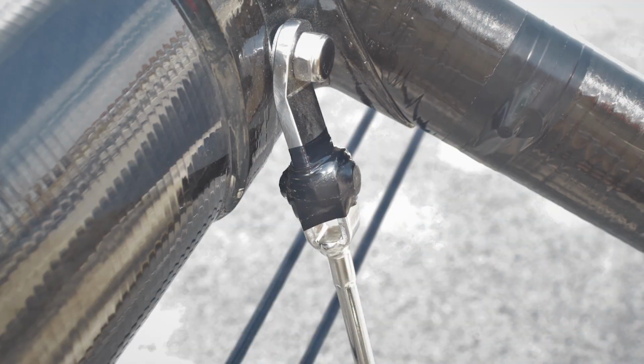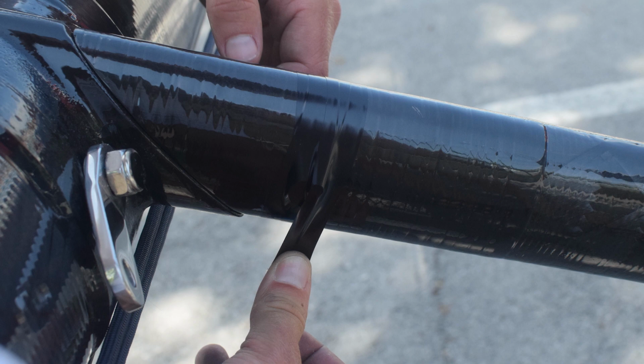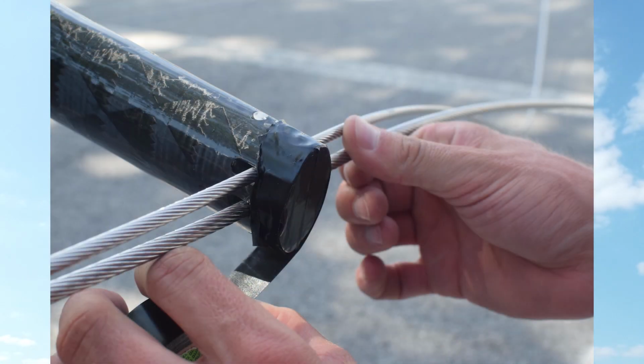After rigging the mast, it's really important to tape the 3 points: all shroud attachments, pins of the spreaders, and spreader ends. After installing the tape very tightly, never tear it when you're doing the last run, but always cut it with a knife. Overstretched tape will not glue properly, but if you cut it, it will last for the whole season.